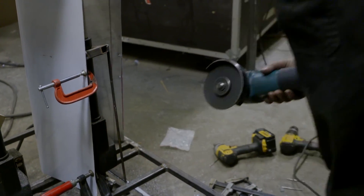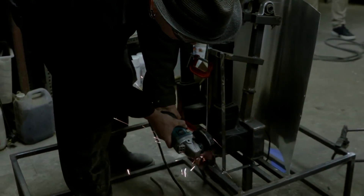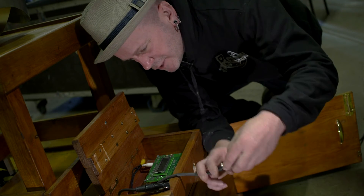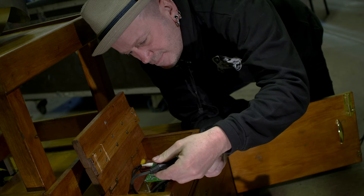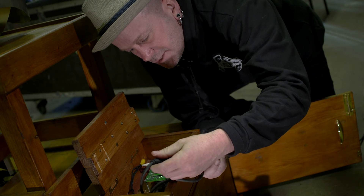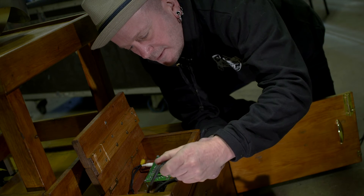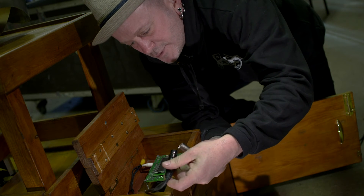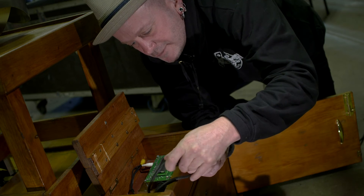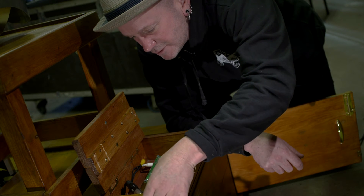Right now he's still metal, and when he moves you'll see a little bit of soul. This is the Rapu unit, which is kind of Eric's brain — it's where I program all the movement sequences into him and we can trigger them independently. It also has his voice in it, and it runs on DMX or independently depending on what you want to do with it.